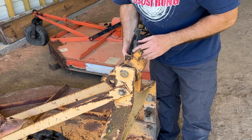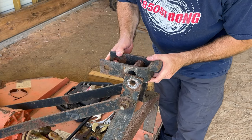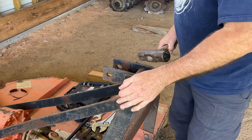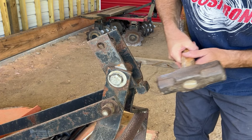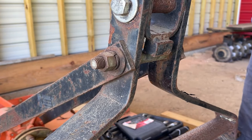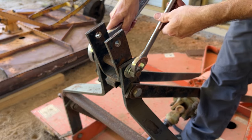To make sure we get it put on correctly, I'm coming over to the one that's correct and lining it up, then walking it over without moving it in my hand to make sure I put it right on the other one. So this stopper here goes in the up position. These are bent a little bit so I've got to hit them with the hammer — they're actually not too bad. One thing you never want to do with a bolt is force it through a hole and mess up the threads. You can see as I hit this towards there it can only go as far as the bolt underneath, and once it hits that bolt underneath that's as far down as the brush hog can go. So this is the way it was designed to be put together. I'll just tighten it back up and it's ready to brush hog.